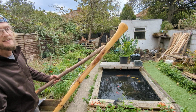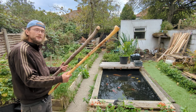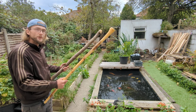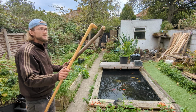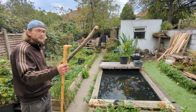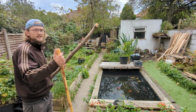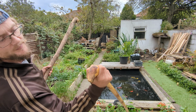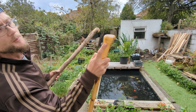Look at the grain in that. It's awesome. You're going to lose strength even as you go down through your 60 grit. But of course, to remove all your tooling marks, you've got to remove a certain amount of material. So the finishing is all about being mindful about the sculpting process and getting it down to being smooth as eggs like this. Oh, look at that. That's what you get if you stick with it. A bit of mould mark on the front there.